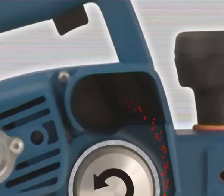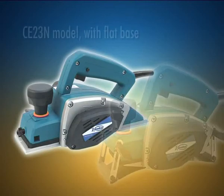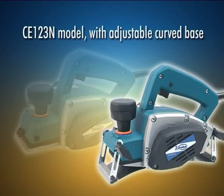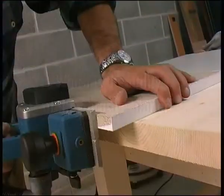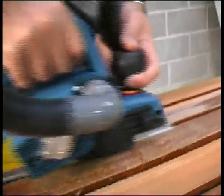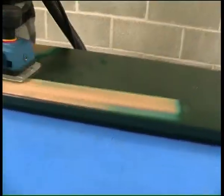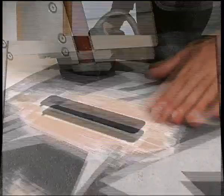In addition, the roller spins in the direction of planing, which means the dust is guided directly to the dust removal nozzle. There are two models of abrasive planer: the flat base CE-23N and the adjustable curved base CE-123N for curved surfaces. These next-generation machines can be used for a wide range of applications — those mentioned here are just some of the most significant in which the abrasive planer shows outstanding capabilities.